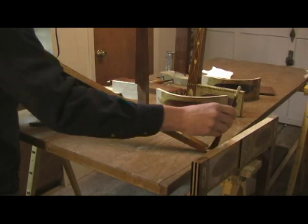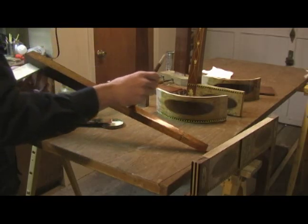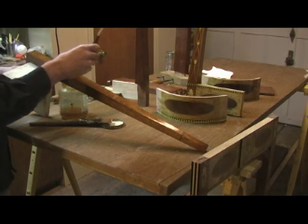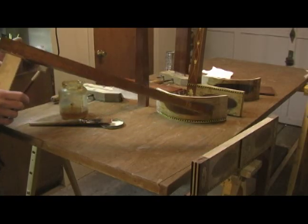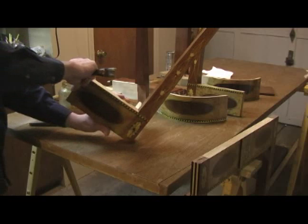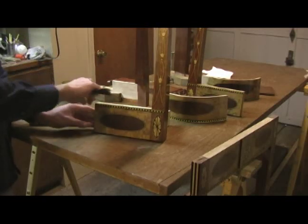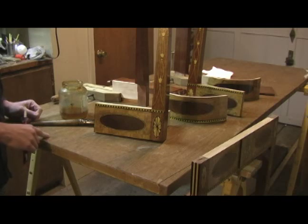It's that light touch that's important and, of course, the consistency of the shellac. That's pretty much all there is to brushing. I'll go around and apply the coats as described, allow them to dry for three to five days depending on the temperature in the shop, and then they should be sufficiently hard to do the rub-out.